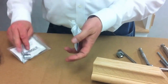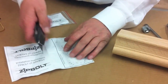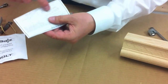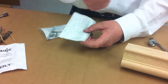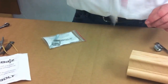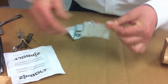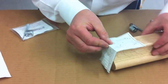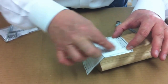In the Zip Bolt Stair Package comes some concise instructions. It's the same boring configuration as you're used to with any standard rail bolt. You can use this template — just cut that away. It gives you the depth of the holes and what diameter bits to use. It's the same quarter-inch hole for the lag end, same three-eighths of an inch clearance hole, and same one-inch hole where the head goes in. Fold on the line as instructed, and set it up for a 6010 style profile.